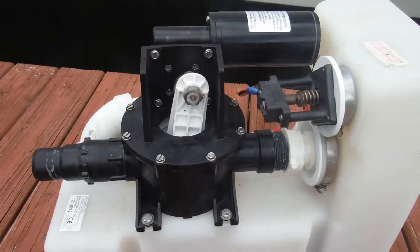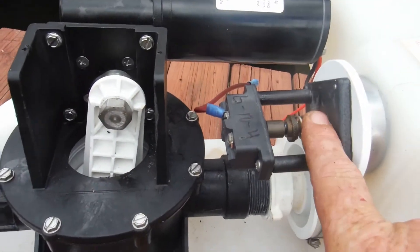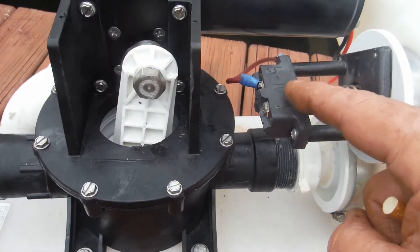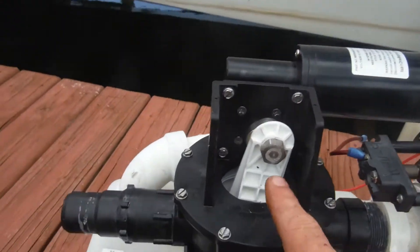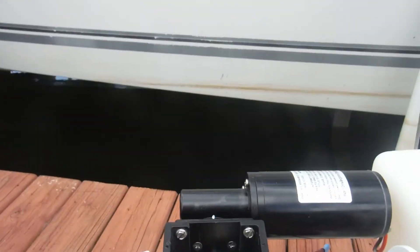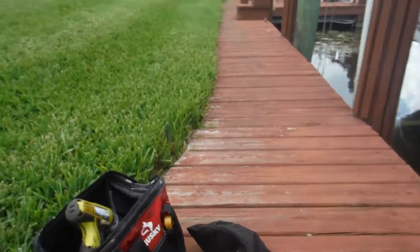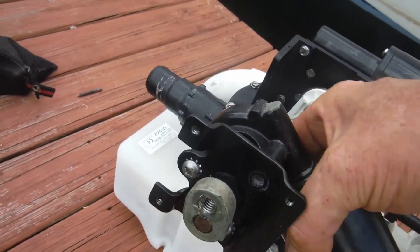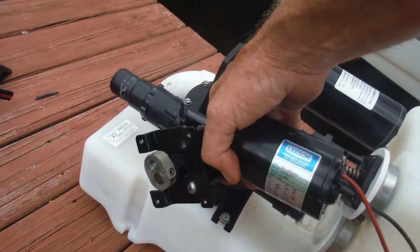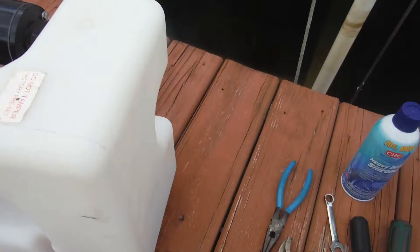Here's the VG — this is a vacuum generator. It's not a VG1 or a VG2, it's just a VG. You can see the pressure switch here — it gets sucked in when it's under vacuum and pulls away from this micro switch, which is just a plunger switch. You've got your vacuum generator, and you can see that this motor is horizontal. The old one is at almost a 45-degree angle — not upward but downward.